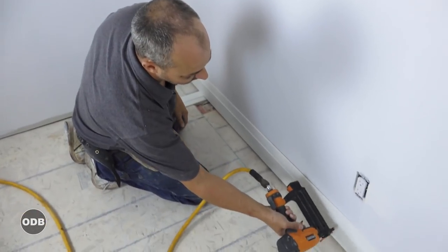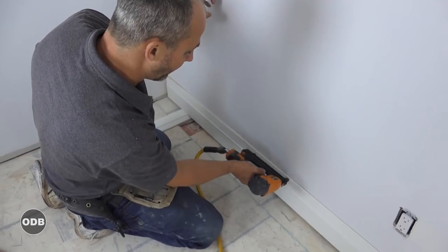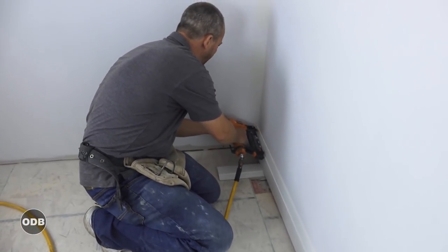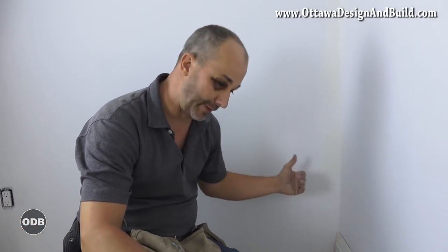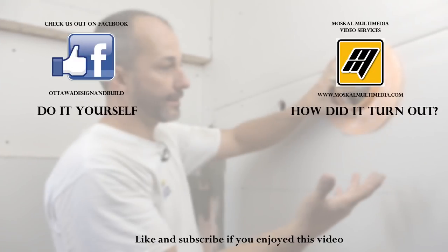Especially beside the electrical boxes, you know where your wood is. Line up on your 16-inch centers and it pulls nice and tight. When you get to the corner, feel free to nail that in and manipulate the other side to close the gap the way you need to when you join that piece of wood. If you enjoyed this video and like these tips and tricks, subscribe to the channel and hit the like button — we like to know what you like.